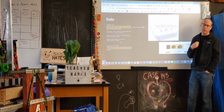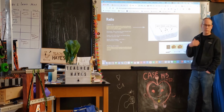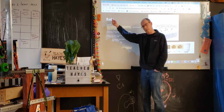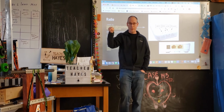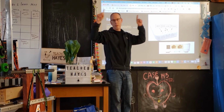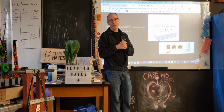What you're talking about is really the application itself, so it's above all those layers of the protocol stack. It's not really communicating with the radio per se. There is an Ethernet driver on the RoboRio that creates an Ethernet frame. That frame is terminated here, which creates a radio frame that goes to the radio access point. That creates an Ethernet frame that goes across the cable that connects to our computer. So it's going across several jumps of these protocols, but for our purpose, it's an end-to-end connection from the laptop to the RoboRio. Does that answer your question?